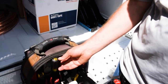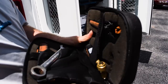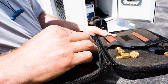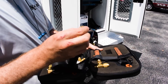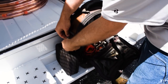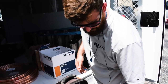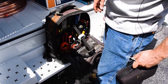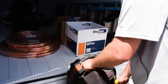I keep my Testo probes in the case with a nine sixteenths. I got a charging T — just a 90 degree on this because it fits pretty much every condenser that way. I got another charging T if I need to remove a little bit of charge, and then a five sixteenths elbow adapter, because usually the elbow is the one I need. I can clip it on here — that's another reason I like to wear carpenter pants. If I'm climbing a ladder to a roof and all I'm doing is checking that, I can clip my meter on or both. It does rattle a little bit, but it's better than dragging the whole thing to a roof when you know you don't need to do major surgery to a unit.